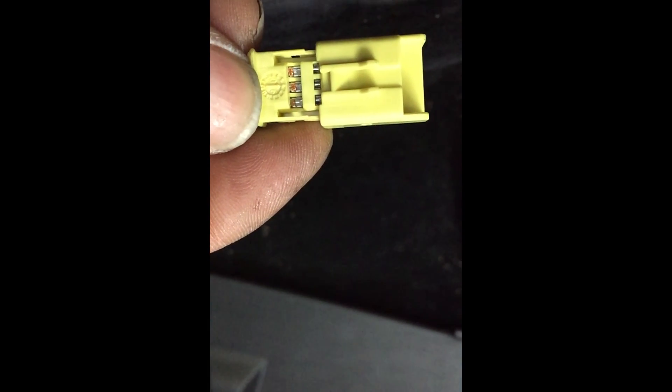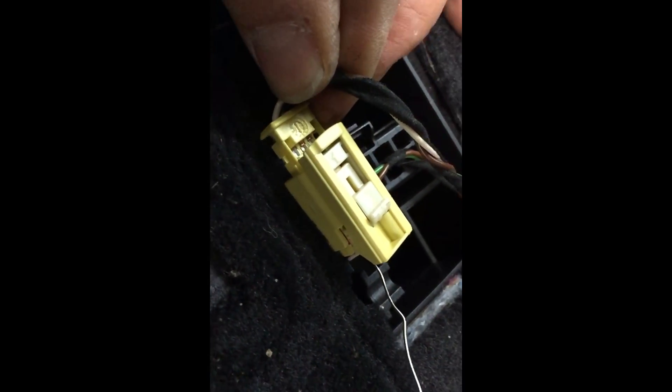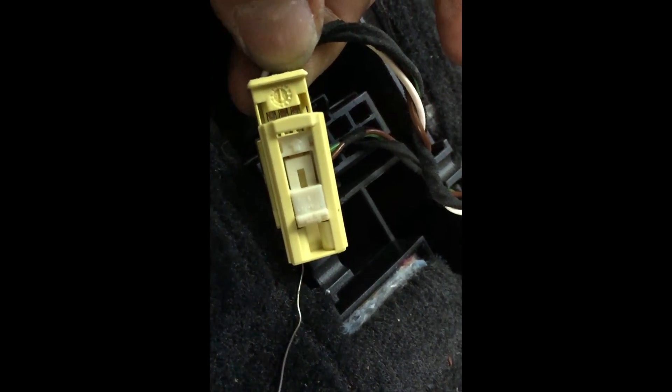I lift the purple connector off — you take it off — and now it will show you the connectors. I put the pin into the white connector, that's the first wire I will test, and there are the wires showing on the other side so I'll be able to connect and check for continuity. Unfortunately for me, the wires are fine — the continuity is fine — so I will go to the second plug now.